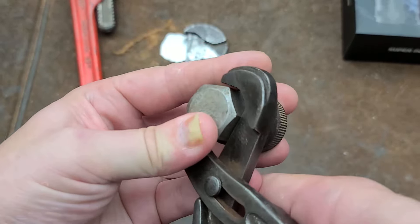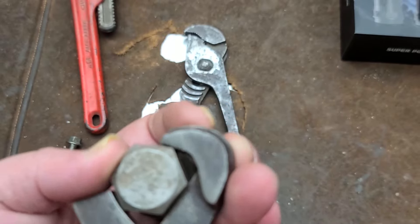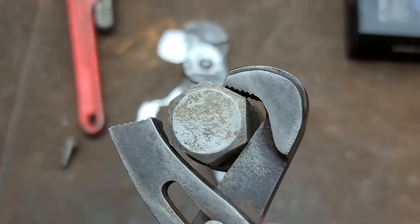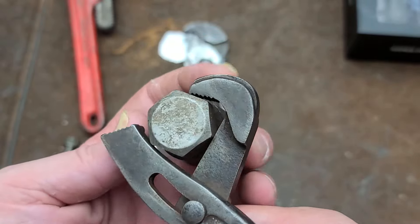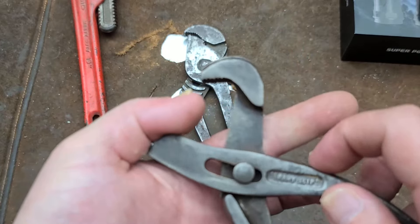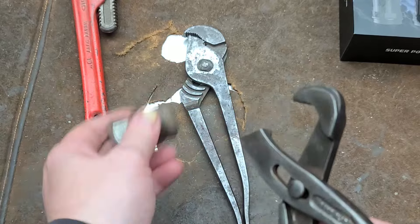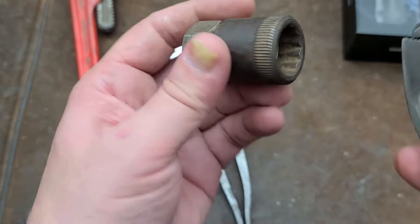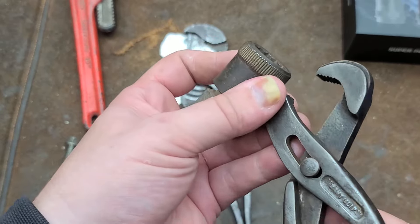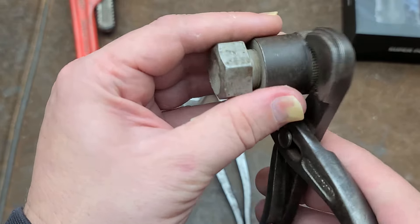These have the distinct advantage of being able to turn the jaw 90 degrees. It's a little funky, but you can still grip onto a fastener far larger than it's really meant for — the edge of the jaw will actually grab. You can go a little further out too, and while you wouldn't be able to break bolts, you'd be able to grasp and work some bolts out far beyond its normal capacity. There's also the ability to hook this onto something and use it as a pulling tool, which would be handy for slotted lock nuts — the kind often found on machine tools.